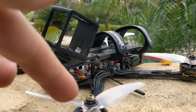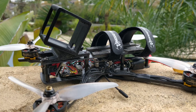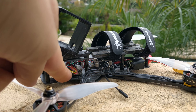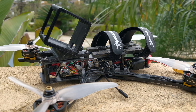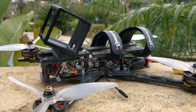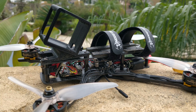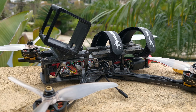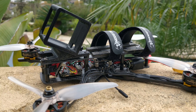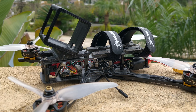That 97 gram weight is without the four screws in the middle, but it does include the camera mount. There's also a lightweight version at 84 grams, which is my favorite version — though I don't even run it myself. It has 1.5 millimeter plates and 4.5 millimeter arms. The version I actually run has 1.5 millimeter main body plates and 4 millimeter arms, which I don't even sell.